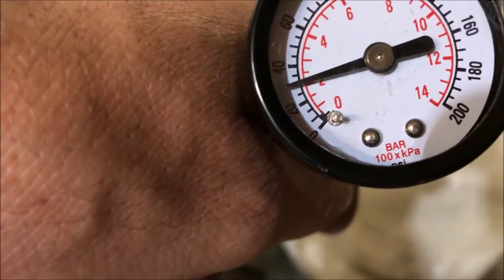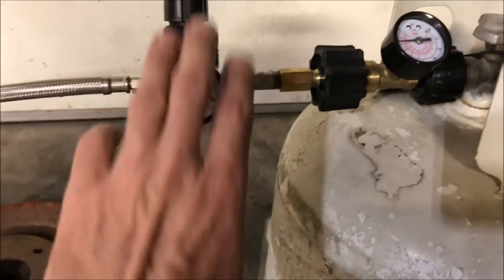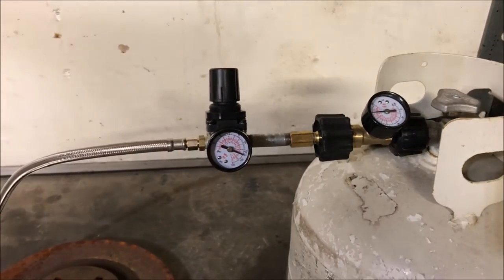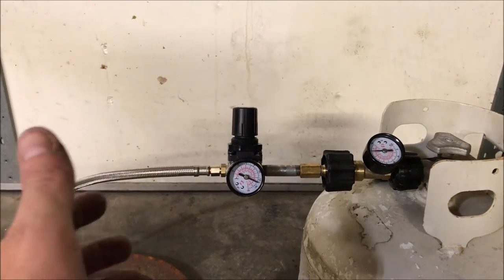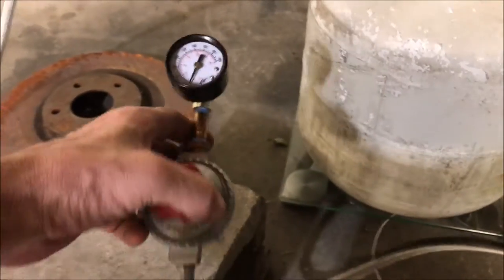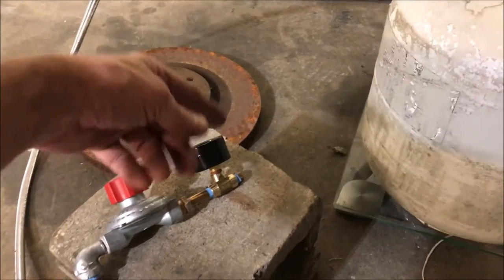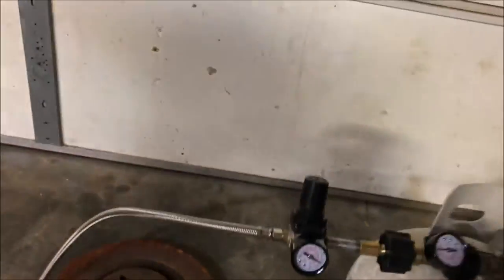Definitely not going to work for my purpose. I'm going to have to use this bad boy right here to run the burner, because if you use a higher pressure and a smaller spud you can still get the same gas flow but you can add more air to your combustion. That's why I can't use this — I could use a spud big enough to give me the 250,000 BTU of propane, but because we're only at 30 or 40 PSI, my spud venturi will only pump so much air.